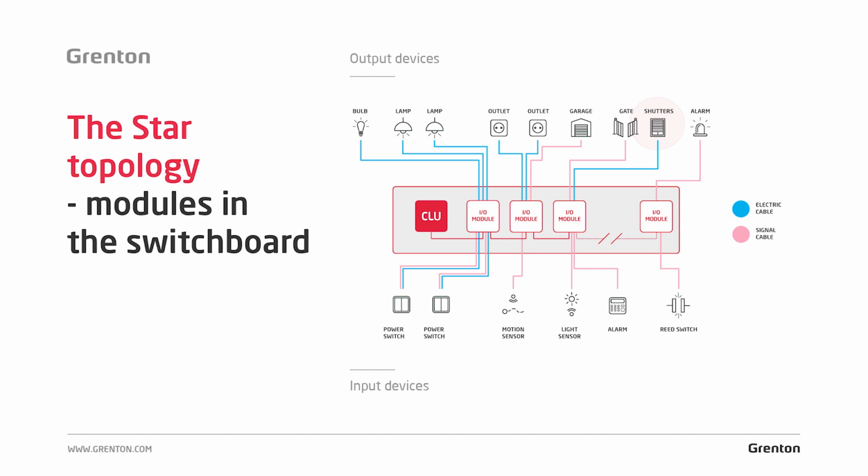How many wires? For blinds we need at least 4 wires for each window, because we have a little more signals for each drive. To each window we need to connect the neutral wire and protective conductor, i.e. we already have 2 wires in the cable, and additionally a wire for controlling the upward direction and a wire for controlling the downward direction. I.e. each cable that we will put into the blind will be a 4 wire cable, for example a YDY 4x1.5.